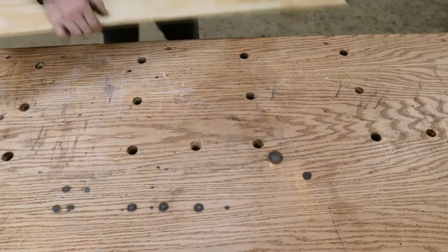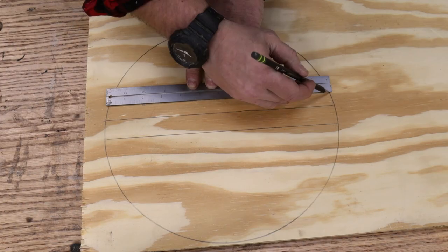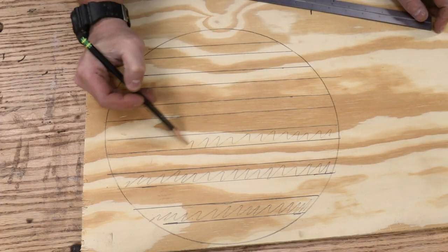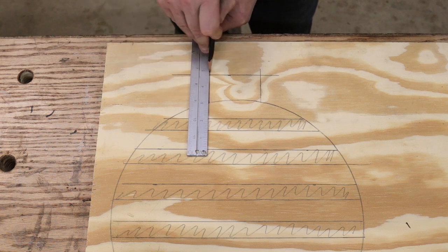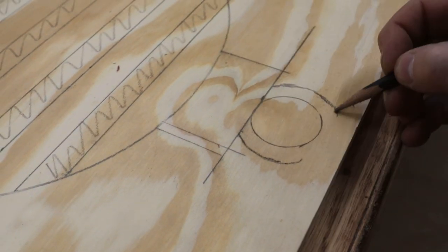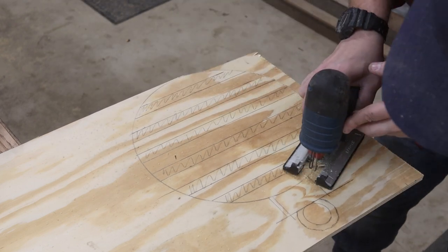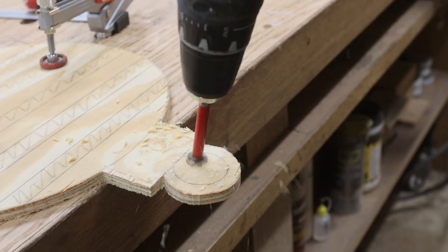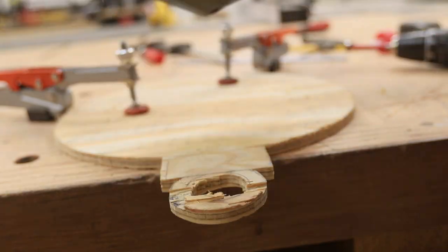Number six. Using the same piece of plywood, this time we're drawing a 12-inch circle, dividing it into 12 sections with a ruler, and highlighting every other section because we're going to be cutting those parts out. We're making a large ornament that you can hang on a wall or put on your mantle. On top of the circle we draw something that looks like the top of an ornament. Then using a jigsaw we cut out the shape, and give it a really good sanding since plywood chips when cut with a jigsaw.